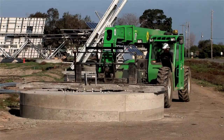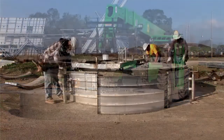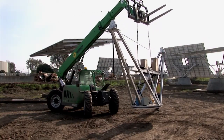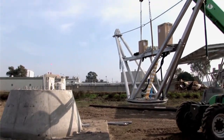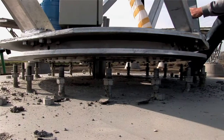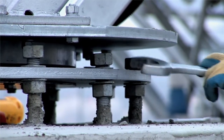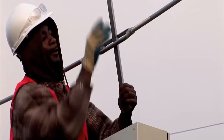The template is lifted off the foundation and the form sections are removed. The tracker base requires minimal assembly on site because they are mostly pre-assembled at the factory. The tracker base is picked up by a tractor or crane and lifted to the center of the foundation. The base is lowered onto the J-bolts by a two-man team, and nuts are installed and tightened to secure the tracker to the base. After the base is installed, a tie bar is installed to connect the two sides of the top tracker base.